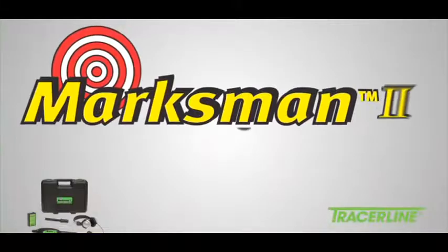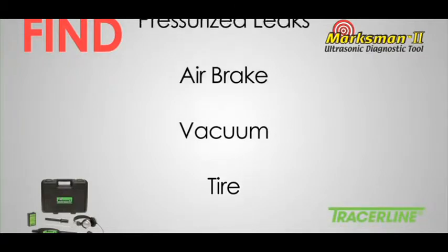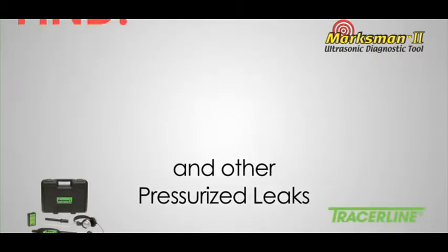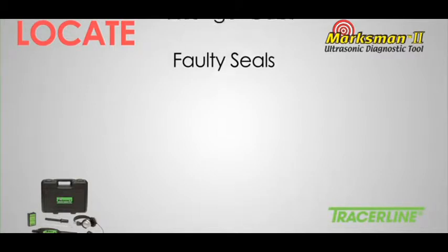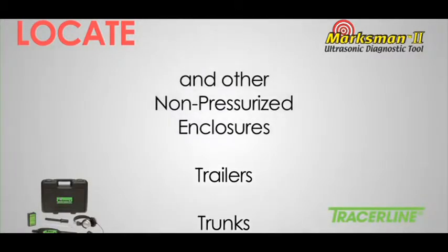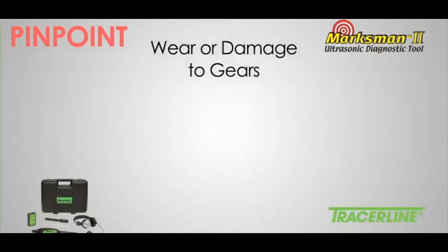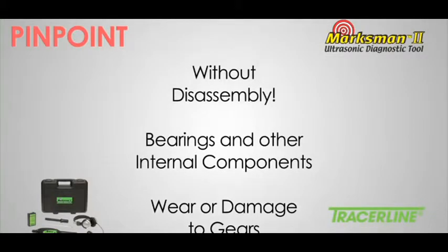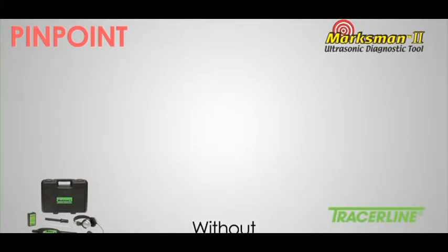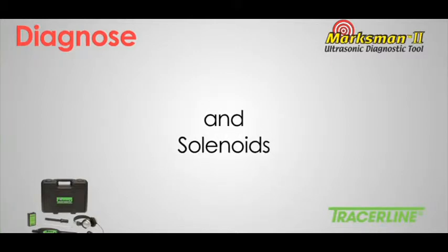Using the Marksman II, you can find tire, vacuum, air brake, and other pressurized leaks. Locate faulty seals and weather stripping in passenger cabs, trunks, trailers, and other non-pressurized enclosures. Pinpoint wear and damage to gears, bearings, and other internal components without disassembly. Diagnose inoperative fuel injectors and solenoids.